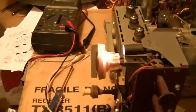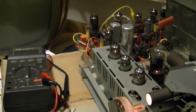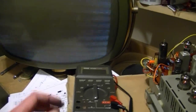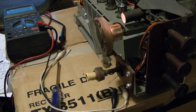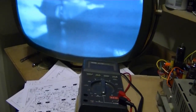Okay, I flipped the tubes around — let's see what happens. They must have a very similar tube pin-out because the filaments light up either way, so they must share the same pins for the filament. If this works, I'm just glad I didn't spend any more time troubleshooting the tuner. Well, that sure looks promising. Stupid power switch. There we go. There we go — awesome.